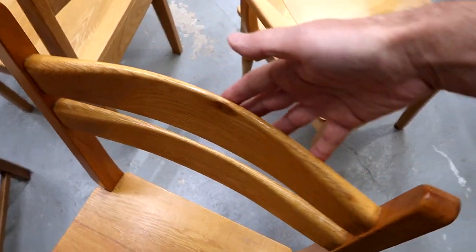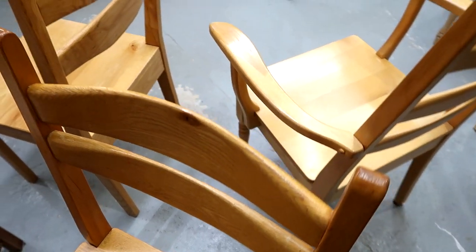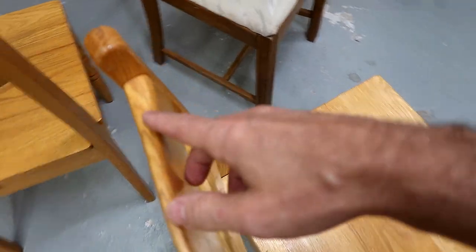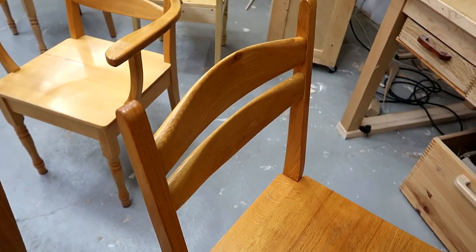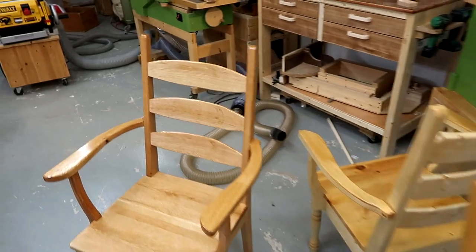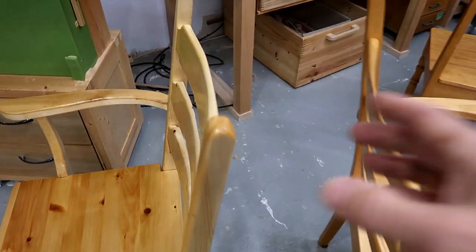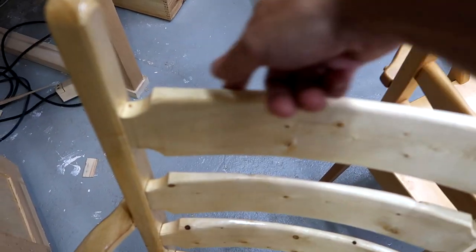These ones too are cut from solid wood, and he got really good at carving out that shape just with a spokeshave. I actually tried copying this chair — though I only had one style with me — so I made that sort of rung and carved it with a spokeshave, but the shape on mine is not as elegant as my dad's. I think it would take a few more iterations to get that right. But on these ones I decided to bend the wood because I didn't have anything thick enough, and I'm very happy with how those came out. For this one, because it's just cheap 2x4 material, I did have wood thick enough and just bandsawed the rungs out of a 2x4, which was really quick.